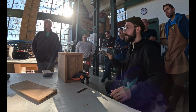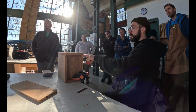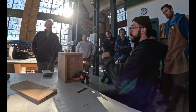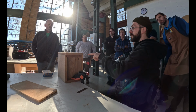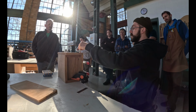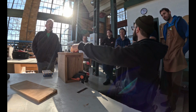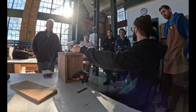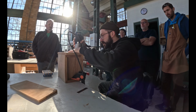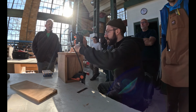Drilling the hole made it a lot quicker too. Yeah, so some of you have really hard wood, right? And really, really hard wood. So he bored a couple holes at the drill press where he stopped before coming through. And then that way when you're cutting through it, it just made some relief cuts. So I'll come and do the middle. And you can get your face guard on if you need it.